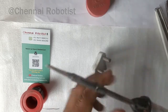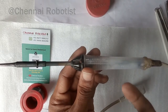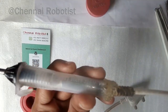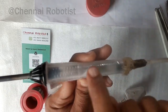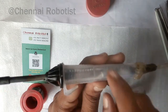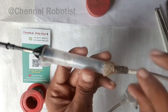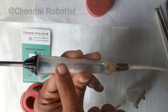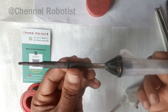This soldering iron is a very cheap model — I got it in the market for 70 rupees. The most common problem that occurs is disconnection of the electric terminal inside. Most people throw it away, but if you inspect it you'll find the wire has just disconnected. To prevent that, I've used glue here to make it very firm so even if the wire shakes, it stays attached. Using this local brand this way, I've been using it for more than four years without any problem.